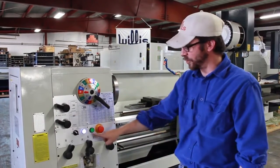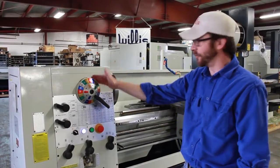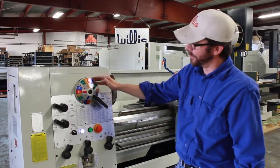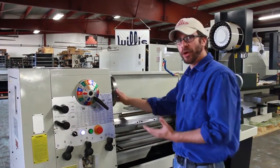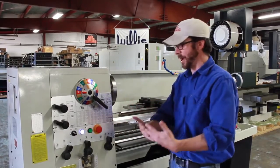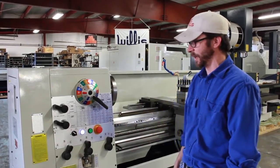This green button right here is a jog button of the spindle. Oftentimes, as you saw earlier, I was able to jog the spindle by hand because it was in high gear. If you're in low gear and doing low RPMs, it becomes more difficult to move the spindle by hand, so you have a jog button which will help you get these gears to mate. You also have your coolant — simply turn the coolant on or off for whenever you need coolant to be used in this lathe.